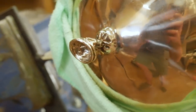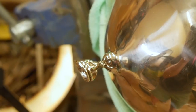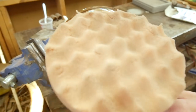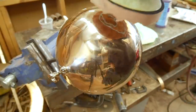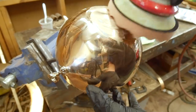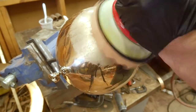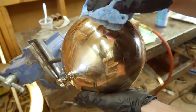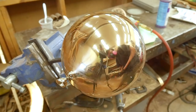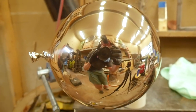This is a quick view of the completed polishing process of the balloon knot. This whole balloon is about two-thirds of the way through — you can see some scratches on the main balloon part still. I also repurposed 3M sanding discs made for paint to polish the bronze. I sanded all the way down to 5000 grit, and as the last step I use a 3M paint buffing compound to completely mirror the bronze surface, using it on an orbital grinder, which is slightly unorthodox. I cut a lot of this final sanding and buffing out — it took many, many hours — but this is the final product.